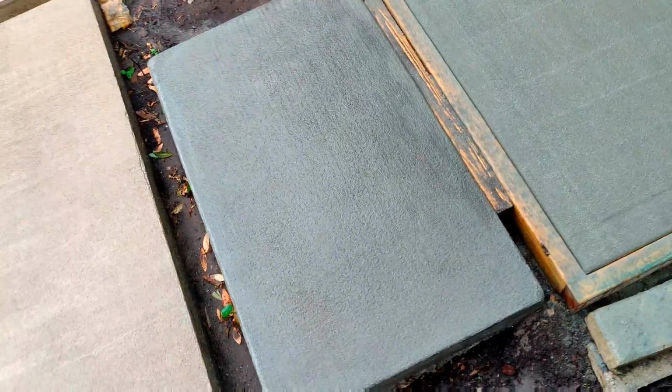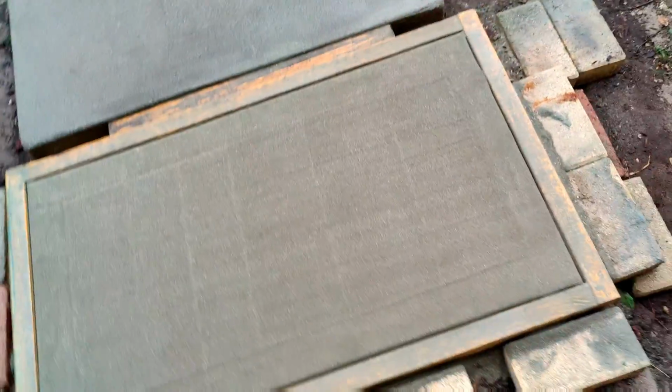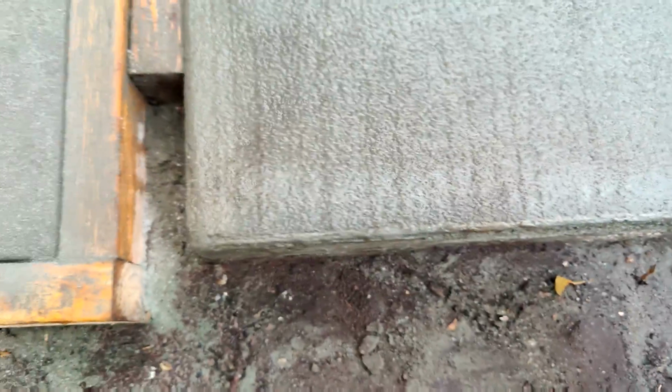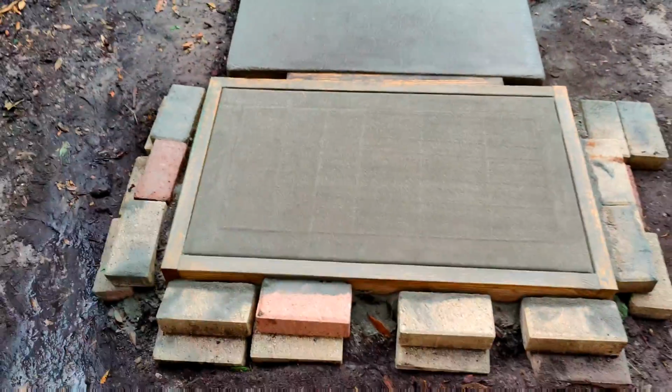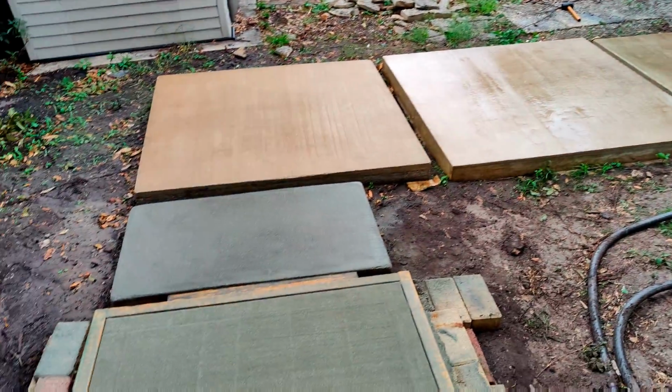So if you mix the wet pour too much, like I said, the sand in the water glass, it gets weak. Then you go try to cure it. It's already kind of weak. It's all broken up. This one, he said the drier it is, the stronger it is. The less water inside of, say, a wet pour, the stronger it is. And then after it's all set up and finished, then you want to saturate it and continue the hydration process. So I'm like, man, maybe we're ahead of the game here.